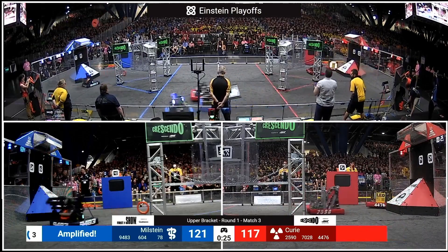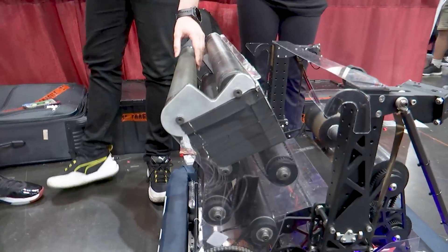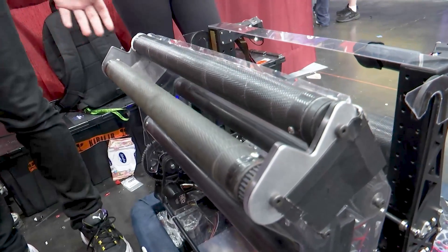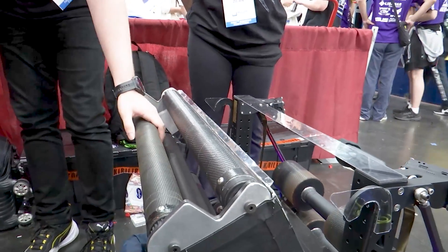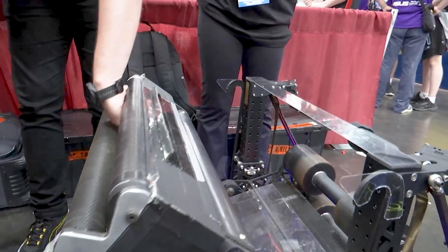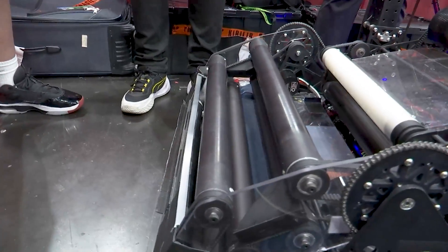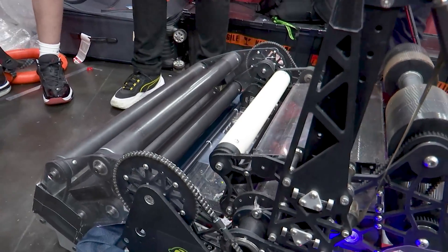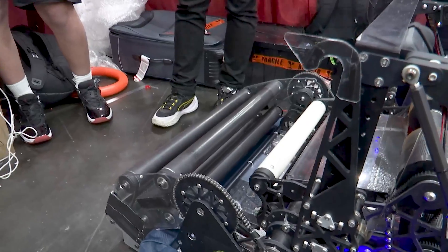Now talk about your intake — it seems like it's a really robust intake. So we have six rollers, and on the front rollers we use a tape named Cat Tongue, which increases the grip rate. We use polycarbonate rollers — their normal grip isn't that much, so using Cat Tongue on the front rollers gives us more grip so we can pull notes inside. The other rollers guide notes along a curved line rather than a direct line, so they feed through more easily and avoid jams. Using polycarbonate keeps it lightweight, though we need aluminum shafts inside the rollers to prevent cracking.